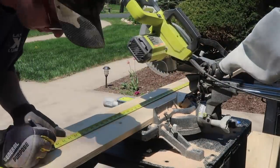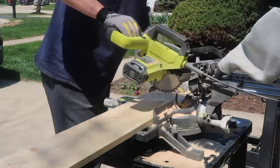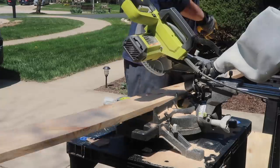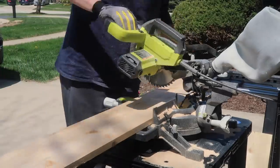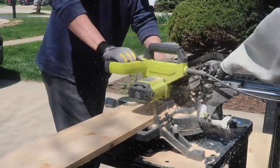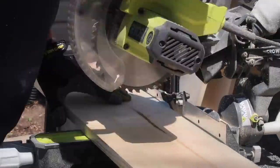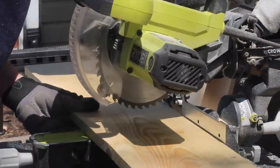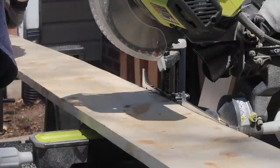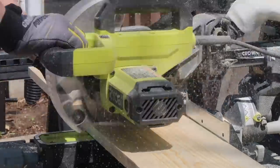The footboard is four 1x8 slats and the headboard is five 1x8 slats. The width of all of them are exactly the same — 76 inches across — so in total we needed nine pieces at 76 inches, and Alex went through and cut all of those. Some other measurements you'll definitely want to make as you go instead of cutting at the beginning — things like trim that are dependent on other cuts — because you don't want to cut and then have to cut again. I would suggest cutting your 4x4s and 1x8s first, then start assembling and measure from there.